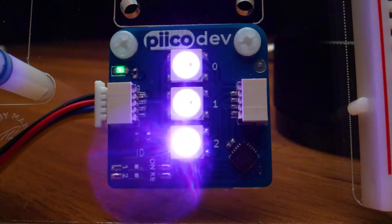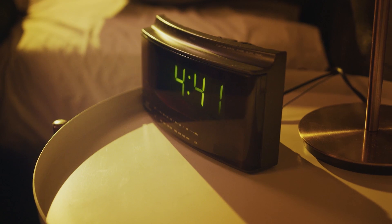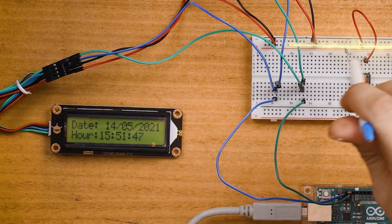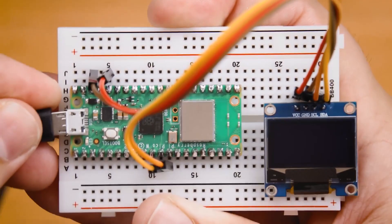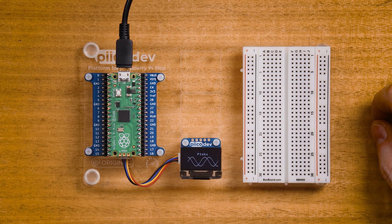Possibly the most effective output we humans can process is something visual. The most basic output is an LED — flash it, change its brightness, change its color. There are a lot of creative ways to output data, and LEDs are cheap, easy, and can be driven with low-spec hardware. Grouping many LEDs together gives a segmented LED display, like your alarm clock — fantastic for number readouts. The 1602 display has more segments and is well suited for letters and numbers. For pixel-based displays, OLED screens are some of my favorites — an awesome little black-and-white display, really easy to use, low power, and you can write text, draw lines, boxes, and circles to make your own UI on 128×64 pixels.